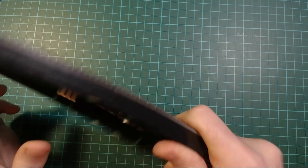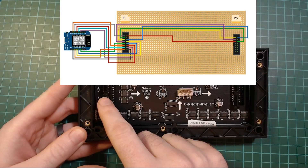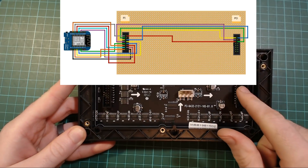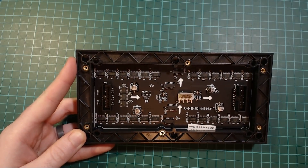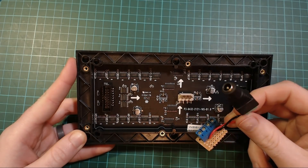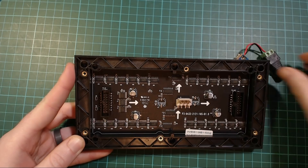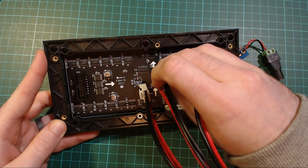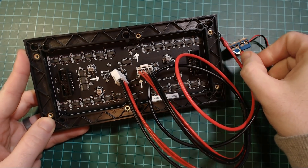There were a couple of awkward things about using it. Basically you had to connect a lot of pins to the ESP8266, and then connect some pins from the input connector to the output one — so there were a lot of jumper wires needed. It was also awkward to power because it needs quite a bit of power, about four amps if fully on. So I made up this little board to attach the power cables that came with it, with crimps on the end plugging into screw terminals.